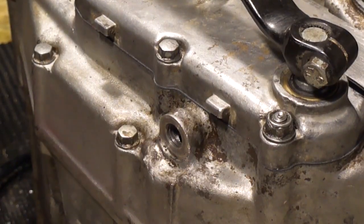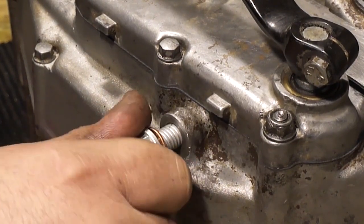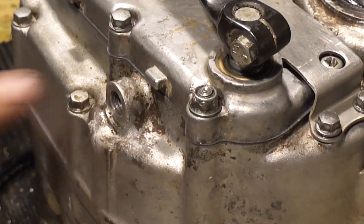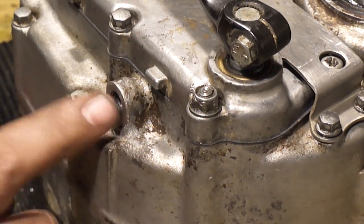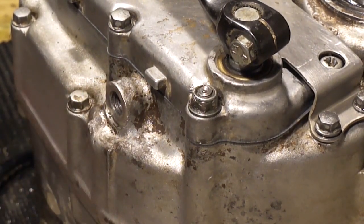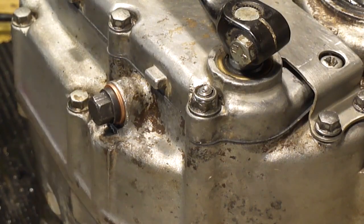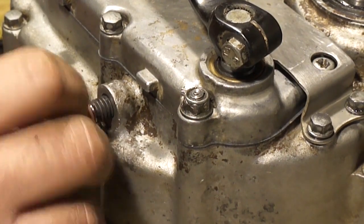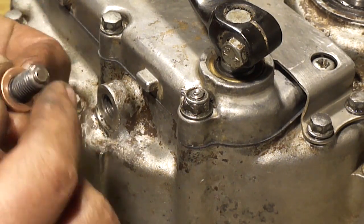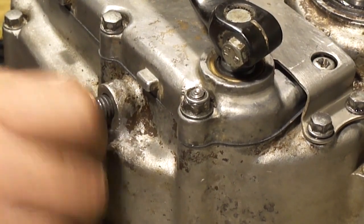So the moment we've all been waiting for — the reason why we're here — the drain screw. Let's get this thing in here. Well, that doesn't thread in there. For some reason this has imperial threads in it — this is 3/8-16, which I'm not sure is supposed to be here. But at any rate, if you don't have a bolt, you make a bolt. So this is a 3/8-16 bolt — it threads in here just fine. I cut a groove on the lathe for the O-ring, the crush washer, bored a hole for a magnet, and faced off the flange. So can we finally plug this hole?